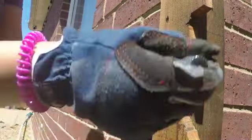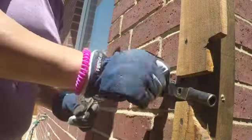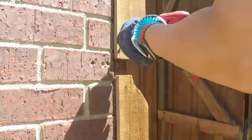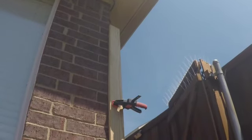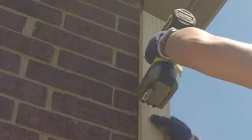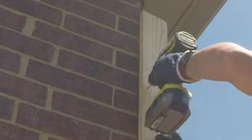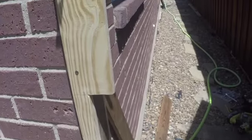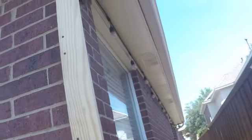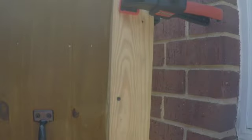So here we are going to remove the latch post and remove those old boards that are screwed to the post, because we are replacing it with board B and we are going to screw it against the post. Then you want to go ahead and clamp board B to the post. You want to pre-drill and then place the screws. Always pre-drill because you don't want to split the board. Here is what it looks like after being clamped, pre-drilled, and screwed in. You can see how board B is laying against the post. My post is a bit short but that's okay - that's why I put two screws up there. Then you do the same for side A: clamp everything, pre-drill, and screw in board A. You can see the notch right there.